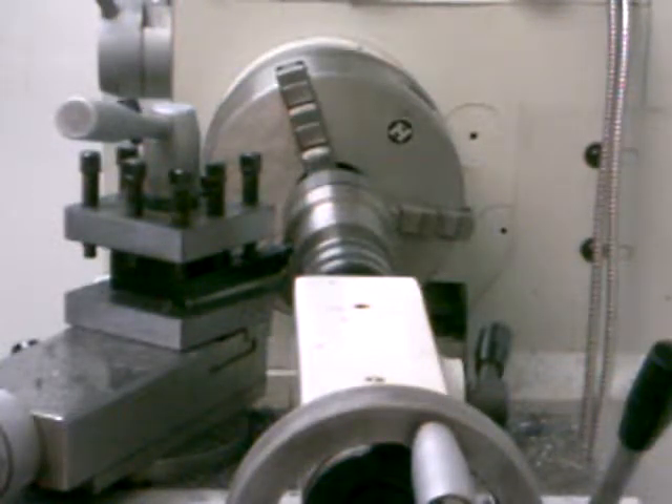Well, this spindle doesn't have that. This spindle isn't quite as long as what theirs have, and there isn't really enough length out there to just drill it and put the set screws in there. So what I'm going to do is make a collar that will fit over the outside of my spindle. It will be approximately the same inside diameter as my spindle, so there will be a step in there. I'm going to drill it and tap it for set screws, and add a spider to the outboard end of my spindle — one of the features of so-called gunsmith lathes, which adds a lot of price to some of the other lathes. This is a project I think I can do fairly cheaply, and it will accomplish the same purpose.